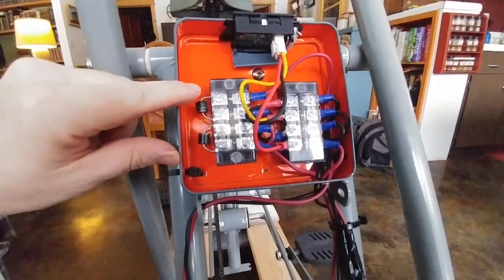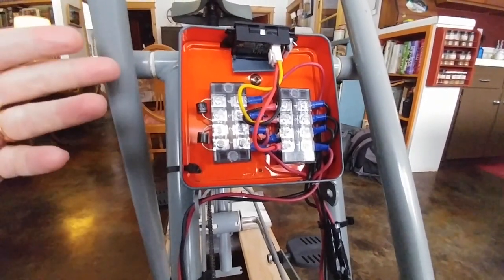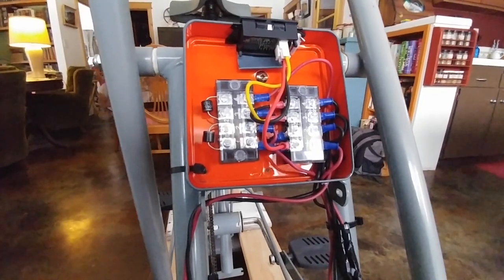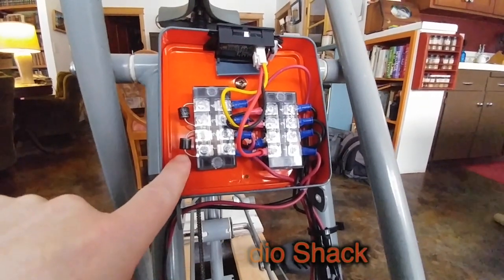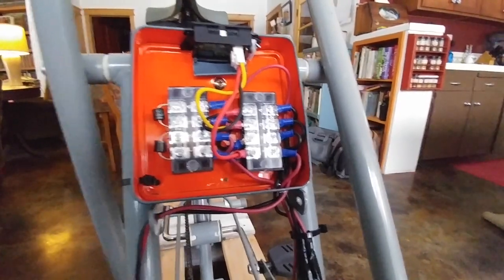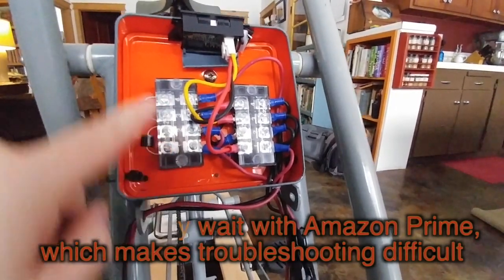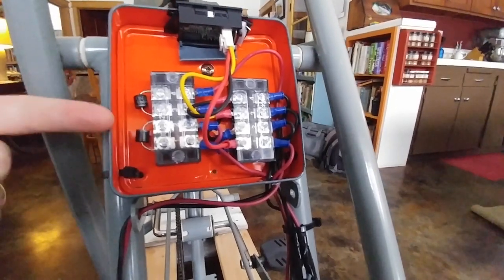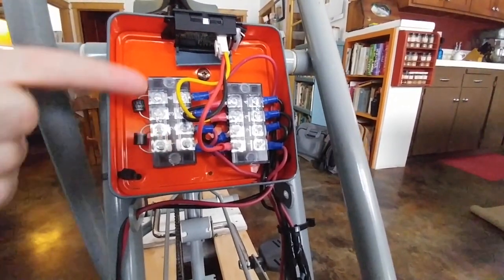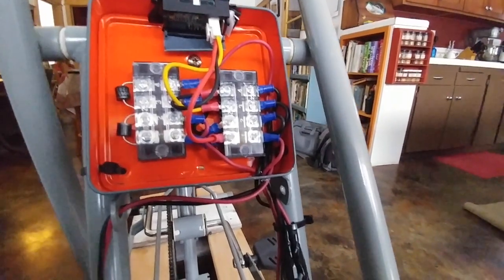Here's my control panel that I created, which hooks up the volt and amp meter into the system. I had to wire the two motors together in series. To do that I had to find diodes — electronic stores don't seem to exist anymore since Radio Shack went out of business, so everything was bought online. I needed a diode for each motor so I don't backfeed electricity into the motor and burn it up. The diodes ensure that current goes in one direction only.